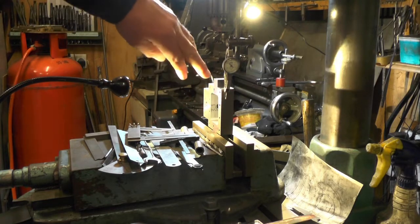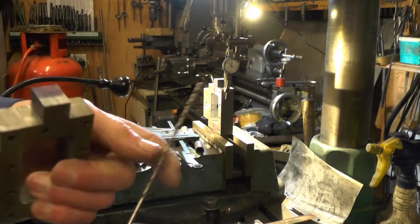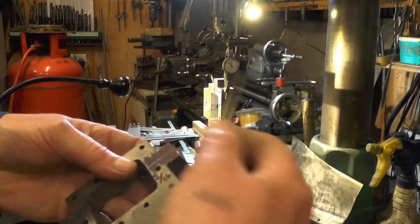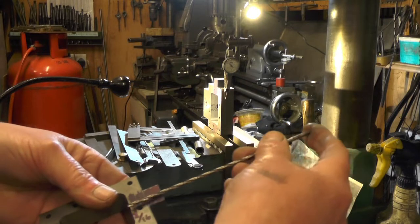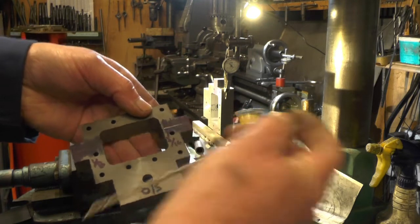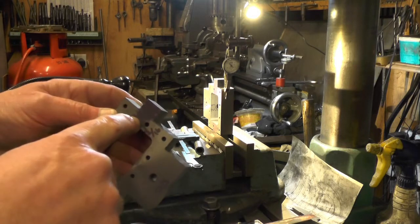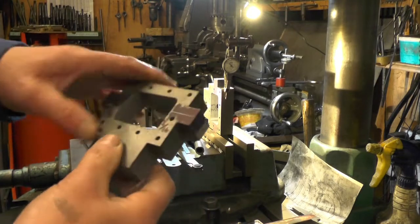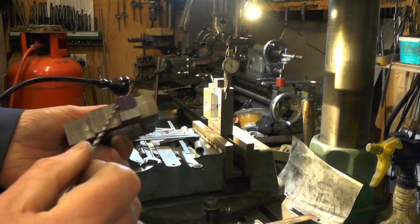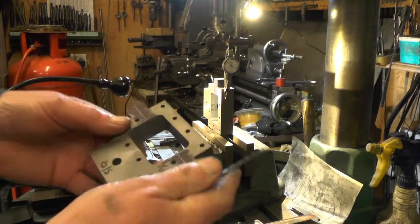So they are handed - remember that. I've got everything centre-punched ready for drilling and I'm going to drill this in my milling vice. I've set it up true with my clock, with that centre line running dead true down both bosses. I've got a one eighth extended drill which I'm going to use so I can go through the three sixteenth side first with this one eighth, then open that up to three sixteenths and put a three sixteenths reamer through. Then I've got to put it in my four jaw chuck and turn a five eighths diameter boss on here where the gland nuts and spindle covers will fit.